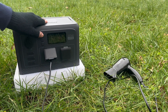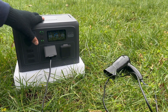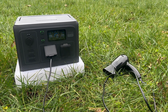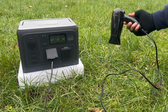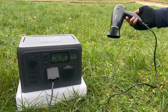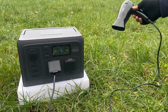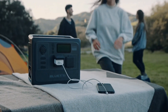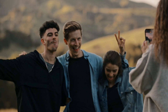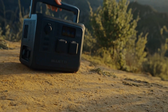Similar to my experience with the 900-watt hairdryer, I encountered the same issue with a shutdown after around 10 seconds, accompanied by the overload message. However, within the Bluetti app, you can activate the Power Lift option, which permits you to use higher-draw heating devices with resistive loads, such as hairdryers. With Power Lift enabled, my hairdryer consistently operated within the 560 to 570 watt range. This highlights both the strengths and weaknesses of the AC60 — it's beneficial that the unit can extend its functionality, but it appears somewhat constrained by its 600-watt rating.